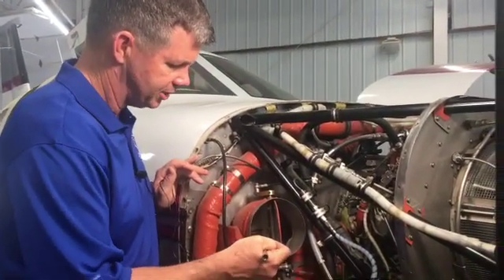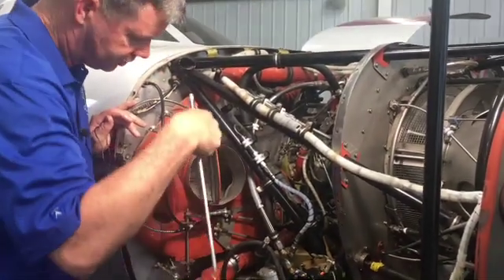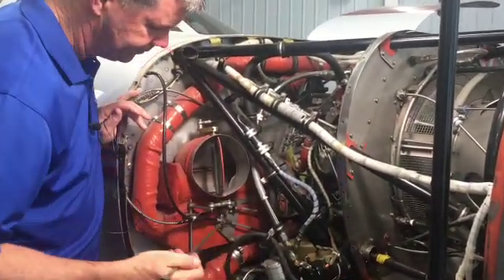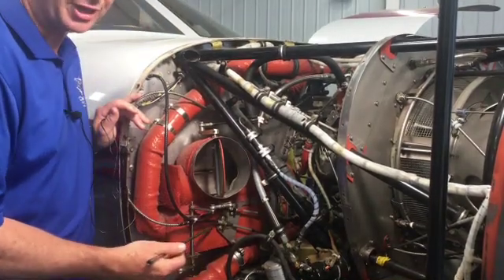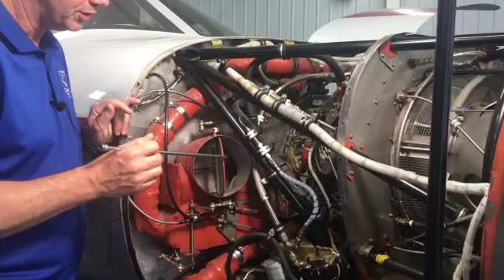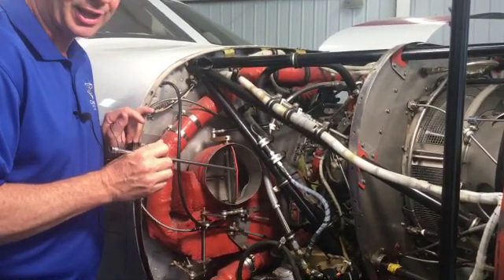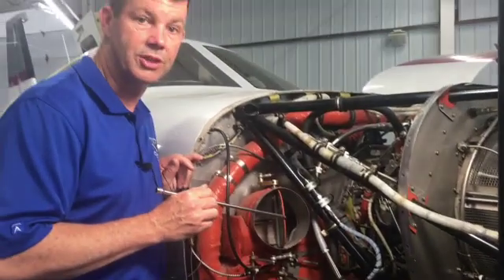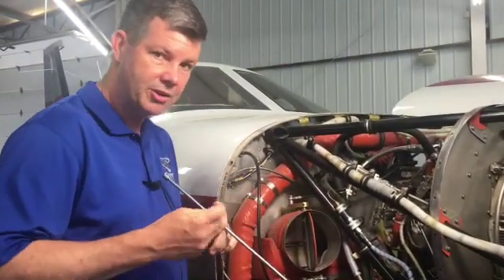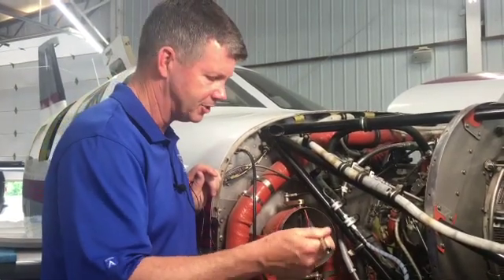This cold air comes in and blows down through — there are vents on the bottom side — so the air flows through the bottom, cooling the air that's going to end up going into the cabin. I have control over this air through this butterfly valve. I control the butterfly valve through the heater knob. I can pull the heater knob and this butterfly valve will close, stopping that cold air.